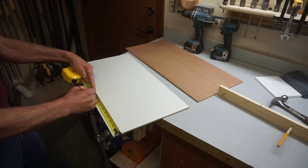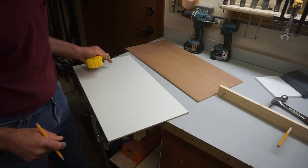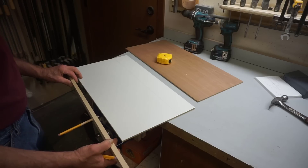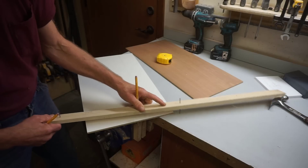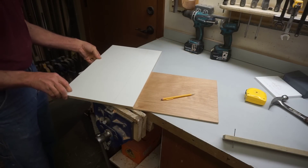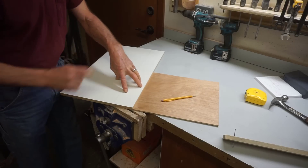I don't need to make these marks because they're built into the stick, but I'm drawing them on here for reference. The pattern piece needs to be big enough so that the two guide points can follow both edges. Because this piece is narrow and the guide nail is going to slide off the end, I'll just tack the pattern temporarily to another piece of material until the ellipse is drawn.